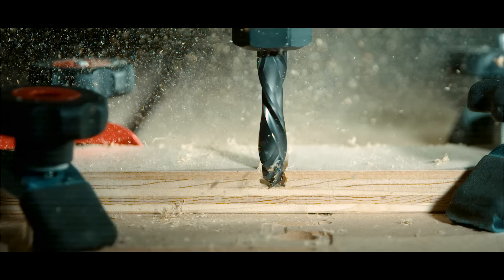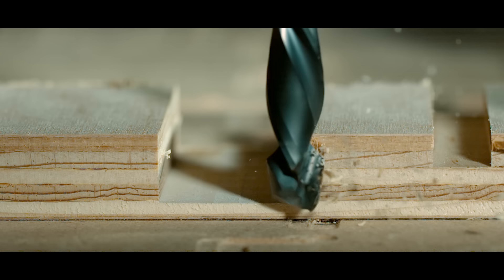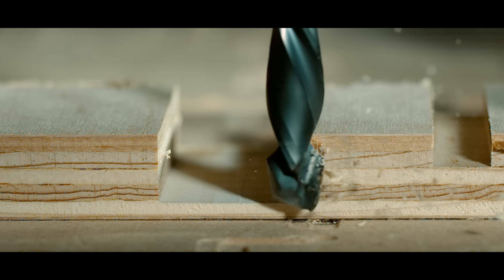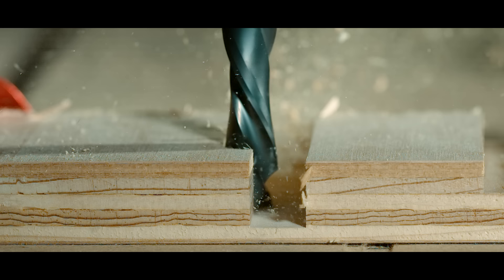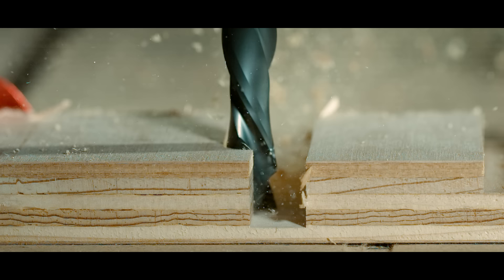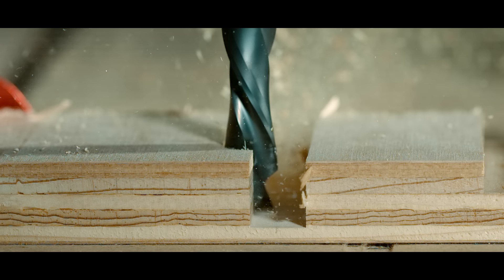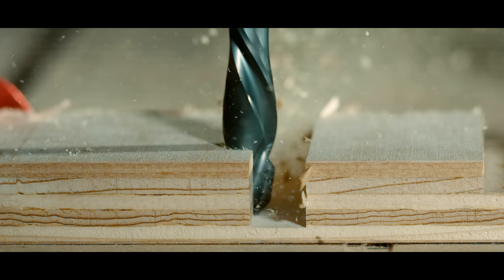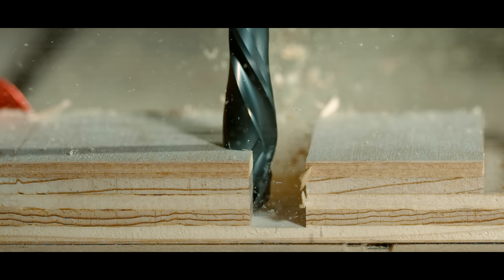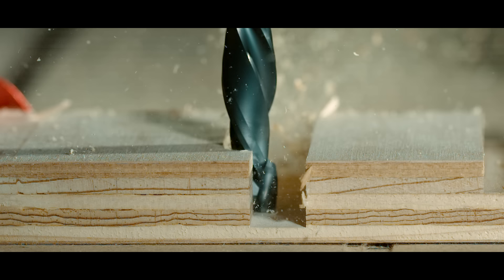So what does it look like when it's done correctly? Here's what it looks like at the correct depth — I'll show you the beginning of this clip, because the rest is too dusty to see. You can see the bottom portion of the bit is scooping chips up and the top portion is throwing chips down. As the bit moves toward us, you can see the top portion looks just like the down cut, and the bottom portion is just scooping wood up. This is the best of both worlds. It allows you to move a lot faster, but you do need to be taking really deep passes to take advantage of it. In typical plunge situations, I would reach more for an up cut bit on anything that isn't plywood. But anything where I'm doing plywood, I tend to reach for my compression bits, along with my down cut bits.